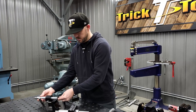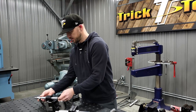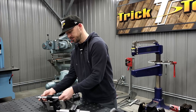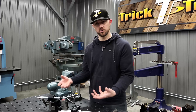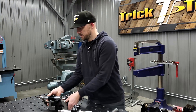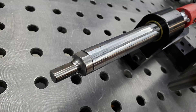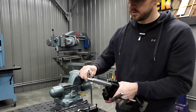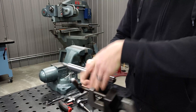It's real easy to swap them out — just thread them in and get them tight. A great feature on both notchers is a flat machined at the end of the shaft. You have the part where your drill holds on, but right there are flats on both sides so you can put a wrench on the shaft while you use an Allen wrench on the other side.